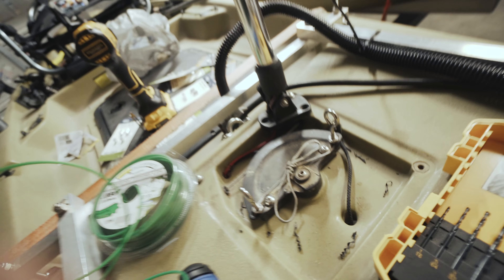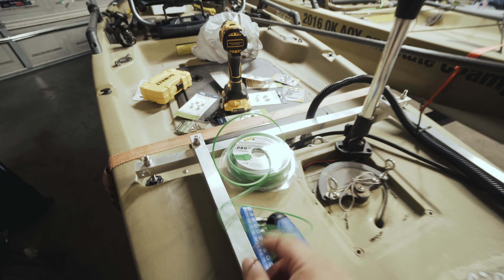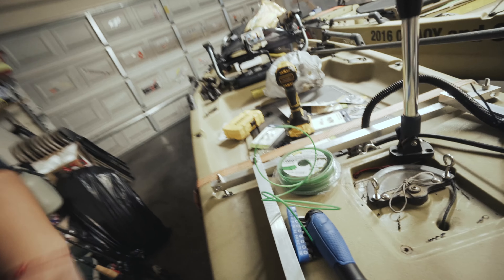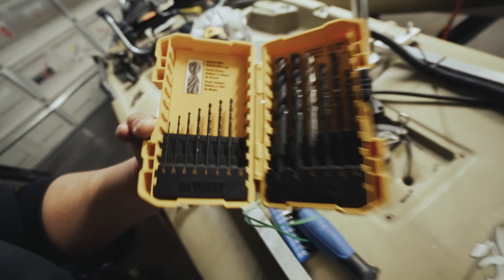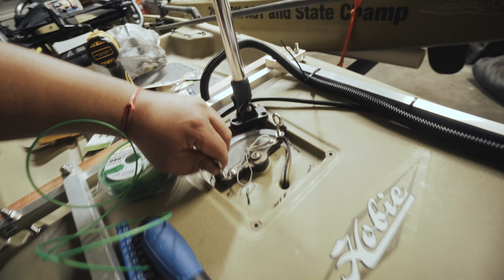Phase 2 — we are going to put some eye bolts right on here and somehow bolt it to this, so when I turn that, this should turn as well. I did some research and came across one guy's post on YouTube. He went with a similar idea, using plastic wire — basically trimmer wire — and he said it is better than metal wire, so I'll give that a shot. Trying to go with all stainless parts here. Some eye bolts, drill it out with a 5/32 drill bit and it just goes right in. Tighten that up so it doesn't spin and you're pretty much good on that end.